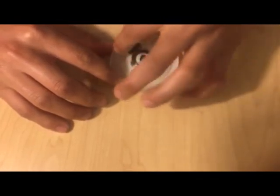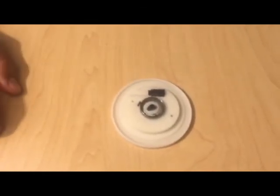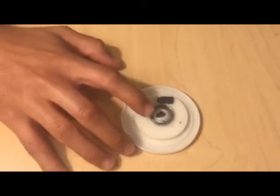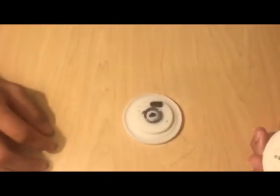And this is how it rotates. The second female jack serves as a port for the audio cables to be plugged into the device. It is connected to the first female jack through a bent jack that is fixed to the top half of the spool. Together, these two parts make up the makeshift slip ring.